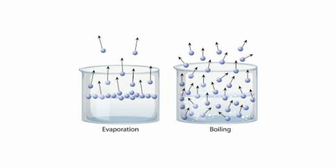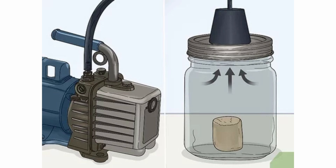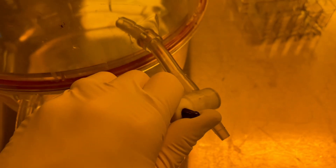Do I think this vacuum pump can do that? Not quite — it's very old and not very powerful. But most standard pumps you can buy can easily do this. Why do I still think it might work? Water evaporates even without boiling when it's just sitting there, because some water molecules at the surface can have enough energy to escape. So even if you don't lower the pressure enough to get it to boil, you are greatly enhancing its ability to evaporate. You can easily build one of these at home or buy one off Amazon for eighty to a hundred dollars.